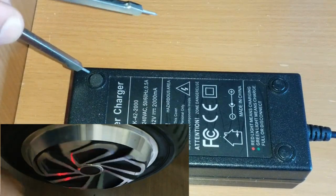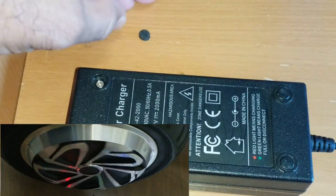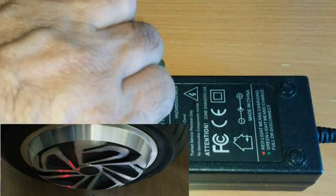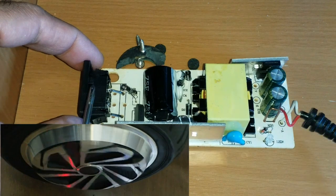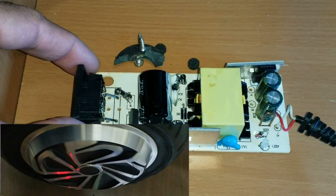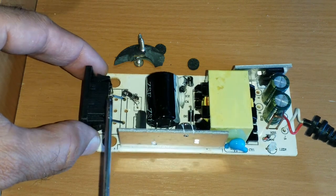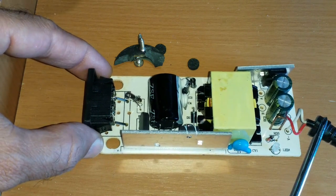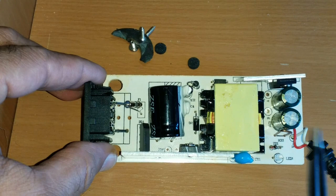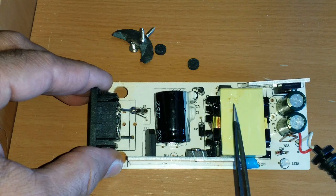You can see here one hoverboard motor I was using before. The charger had a problem — battery fully discharged — then I repaired the battery charger, so now it is fully charged. The main power supply stages are: fuse, filtration, bridge circuit rectifier, transformer. This is a hoverboard AC to DC adapter charger. Input is AC 220 volts, output is 42 volt DC for the hoverboard. The input and output sections are isolated — in between there is a transformer with two coils.